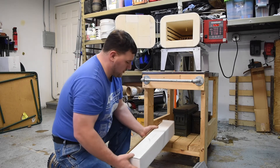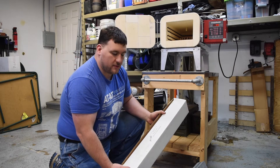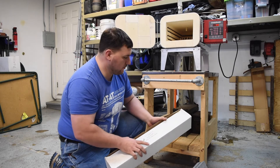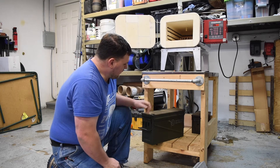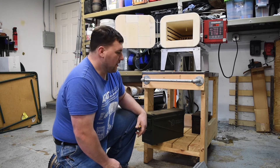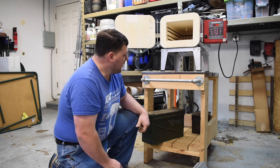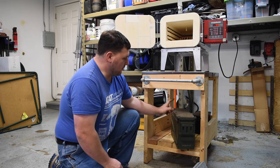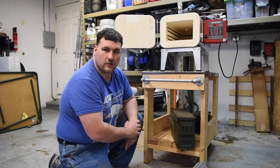Got stainless steel foil — I use 321. It has a max temperature of 2,000 degrees. We go to 1950°F for 154CM, so that will be just right. I also have some ammo cans down here full of oil for high carbon steel that we need to quench. This is a 40-millimeter can, and what's nice about it is the lid comes completely off so you can warm up your oil and dunk your whole knife in there.